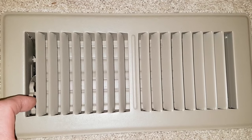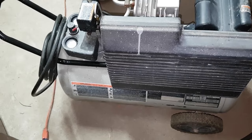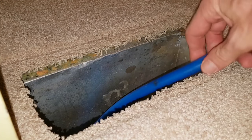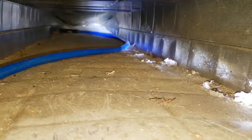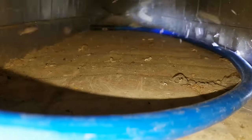With the hose from the leaf blower vac temporarily installed at one end of this duct, I turn off the HVAC unit and close all the vents except the two I'll be working through. Next, the leaf blower vac was turned on and the air compressor was brought up to pressure. Now I move to that other duct opening I chose and insert the whip. The duct work continues past the opening a few feet, so I push the duct whip in all the way to the end. Safety glasses on, and here we go. I plug in the air and pull the whip sweeper back toward me, clearing the debris in this dead-end section.